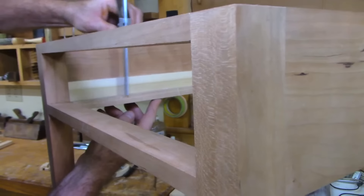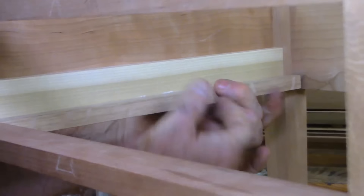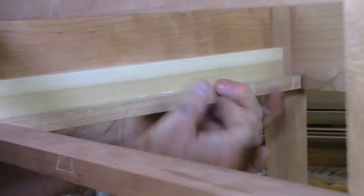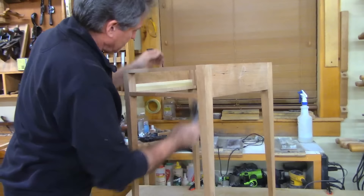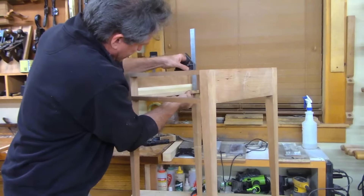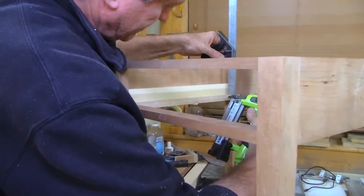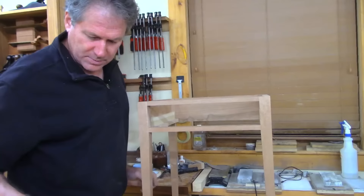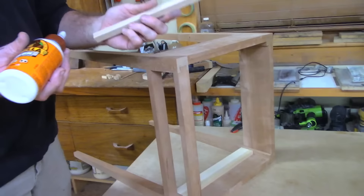The runner rode up — you don't want that to happen. The good news is I only have pin nails in there, so I'll pull it down a little bit. The pin nails are just holding it while the glue sets. I'll shoot another one, being careful not to slip. For those without a nailer, you could use just a little glue, let it start to grab, and use spring clamps or quick-grip clamps — those are my preferred method because you can get them on with one hand.